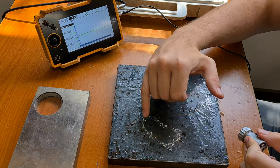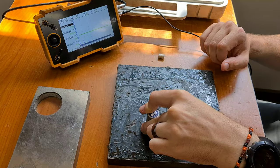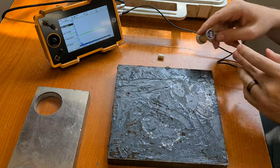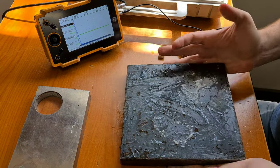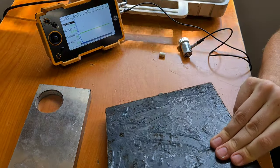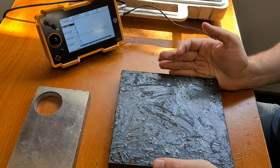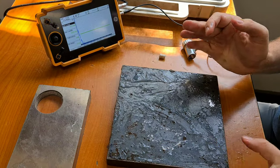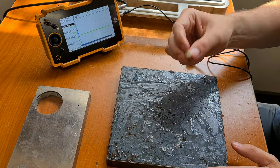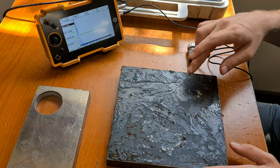Once we complete, we have a rough size of our lamination which you can measure. To get the depth, you can just put the probe anywhere on the lamination and it should give you the depth. I only did the one for this exercise but if we turn the plate over we should see more or less the same size. This is a very rough estimate. If you do this I recommend using a much finer marker than a small piece of chalk, or at least sharpen your chalk. It's just to give you a basic idea of how to size and work with a lamination.